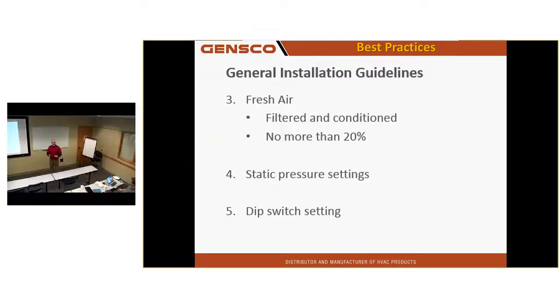We're going to cover some of these dip switches a little bit and what they do. And this is something that the project manager should have a conversation with the end user or someone, the engineer, to decide where these things are going to be set. Because ideally, you only want to touch that unit one time. Not have to keep repeatedly going back to that unit to make a change to it. If you're going to be standing in front of the unit, you should address it, the port address if you know where it's going, any dip switch settings that need to be set, record the model and serial number, make any marks on there you should make.